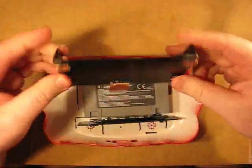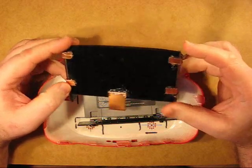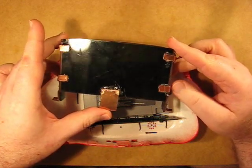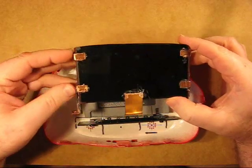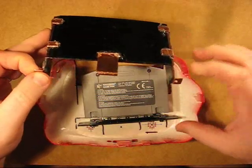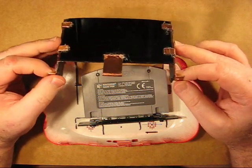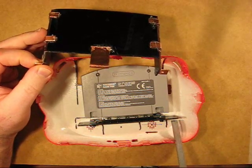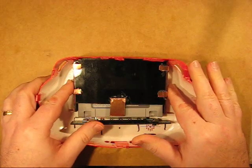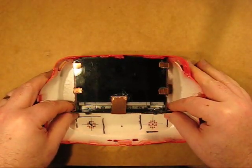This is another part, which is the assembly we'll be seeing from the outside. Basically three pieces of 2mm thick perspex, cut to fit exactly to the inside of the case. I've used some spare pieces of copper, which I've cut and bent to 90 degree angles to make some nice right angle joints. These are hot glued in place and the whole system is really quite strong. These at the back are to secure against the plate itself. I had originally designed it to work with screws — in fact computer screws — however given the angle it works with the case, the screws don't actually turn, so I'm going to have to attach them by a different process. This pushes up against the end, that pushes against this part, and that will keep everything very firmly in place.